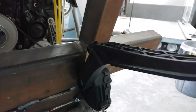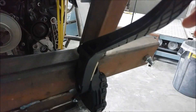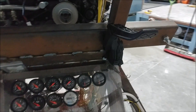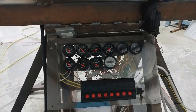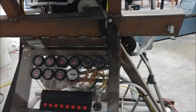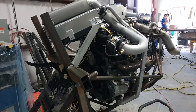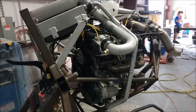Here's the accelerator pedal — just a stock one out of a car for now. I've got a little wedge in there with the spring removed so we can lock it at a certain position. That's going to give us our throttle control initially. Getting really close now to having everything done for the engine, and with any luck we should have it running next week.